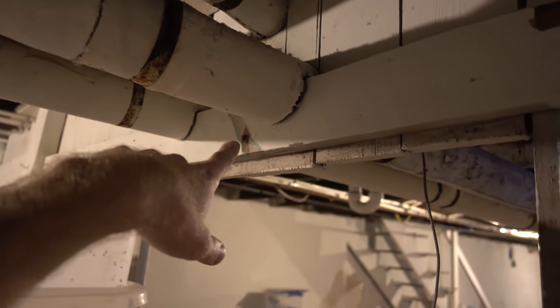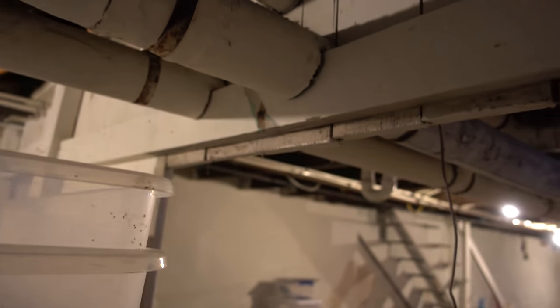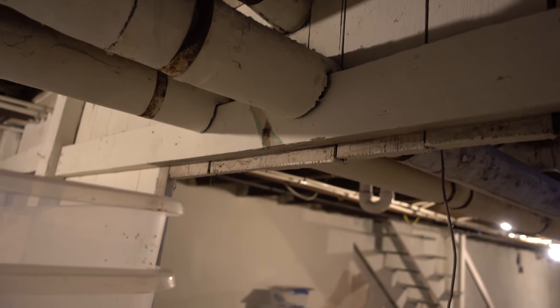I removed a significant chunk of our old divider, which is going to be demolished eventually in total. Getting out of here completely is going to be a little tricky, because we've got these heating pipes right here which pass through it. And with them having the potential asbestos insulation, I don't really want to mess with those yet. So I'll have to be careful, do some selective demolition on that wall. But things are going well.